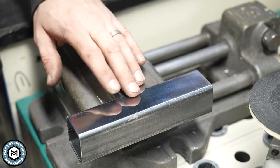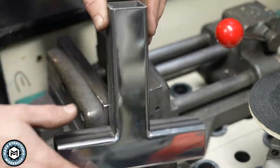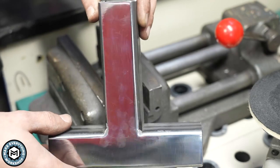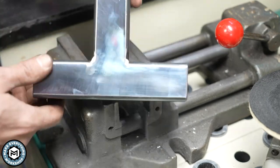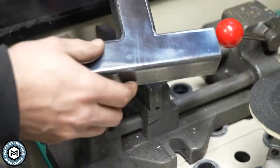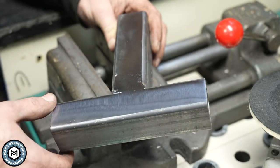You can see right away — you can see the way my fingertips are reflecting in the surface. This is not a flawless mirror polish by any means. The way you judge a mirror polish is how far away you need to be from it to get the mirror effect. You can see how I'm reflecting the grinder over on the bench and down on the vise jaws. Super easy to get there in mild steel. I left the other side alone because I didn't want to catch inside that gap, but that surface conditioning finish is also really nice and consistent, and then if you need to go further, you can go to mirror.